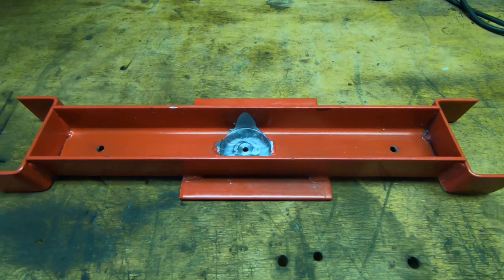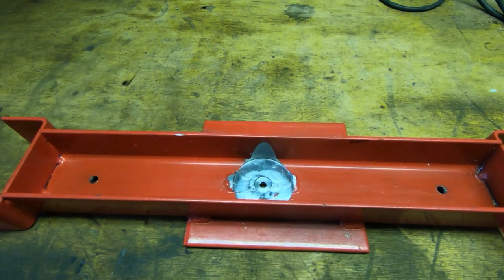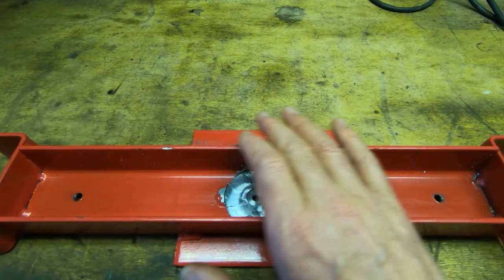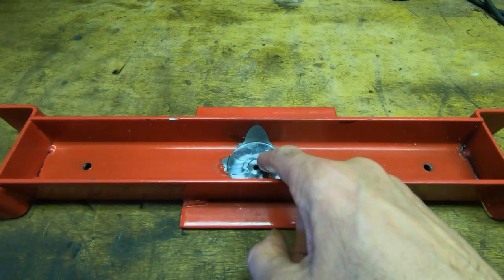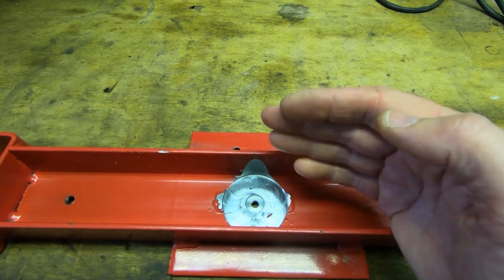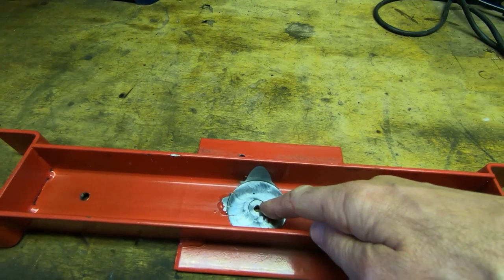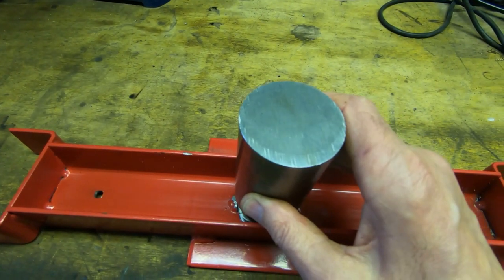To address the first part of the problem — this not being fitted squarely — I've cut the old bar off and machined a cylindrical pocket into the crossbar, going about half a millimetre in. This doesn't carry much load across it so that's not an issue; the force from the jack presses onto the back side of this plate. I've got a piece of mild steel with a central recessed bore to keep everything centred and a hole for a bolt, and I'll now machine this to be a nice sliding fit.